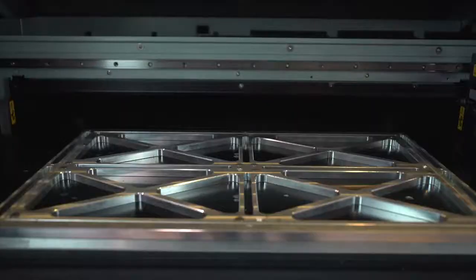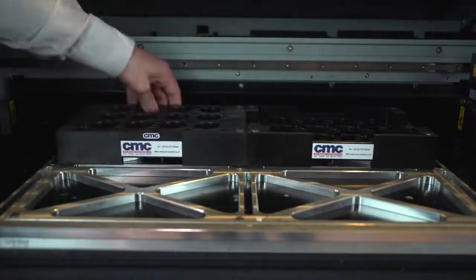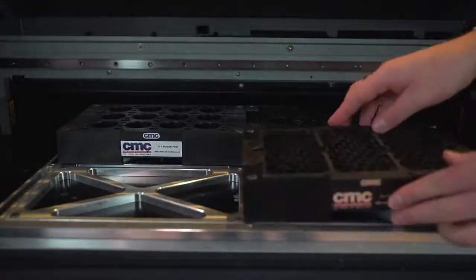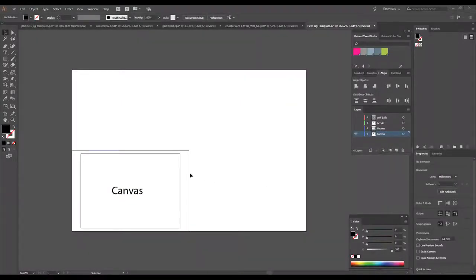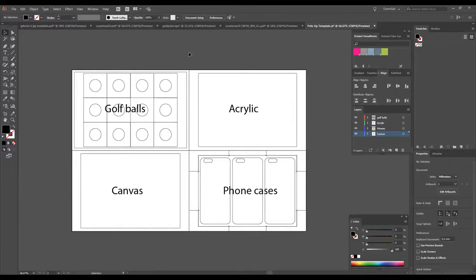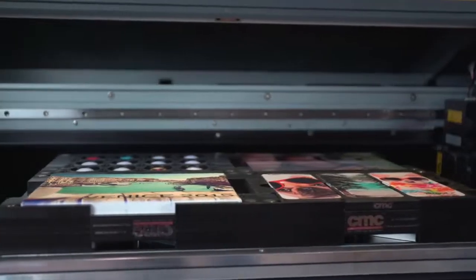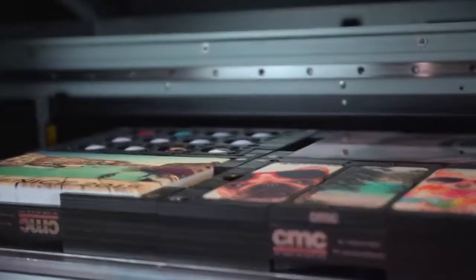When printing multiples of different items at the same time and wanting to change the layout or setup, you may want to create an interchangeable jig system. All of the items need to be printed at the same height, or as close to as possible. In this example we have created a base plate for different setups to slot into, which would be fixed to the bed for ease and speed of changeover. You would then create pods for each product or item you wish to print and a corresponding design file. As you can see, all items sit at the same height, so you can minimize setup time by leaving the print height set at one value.